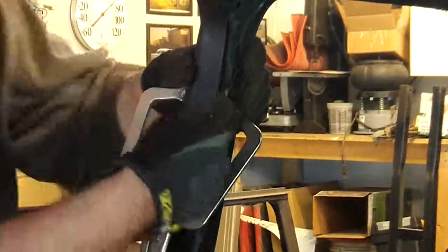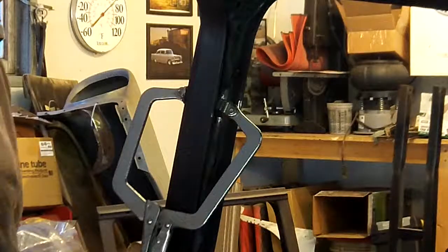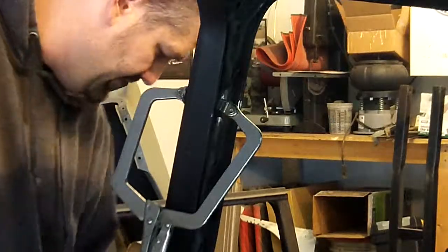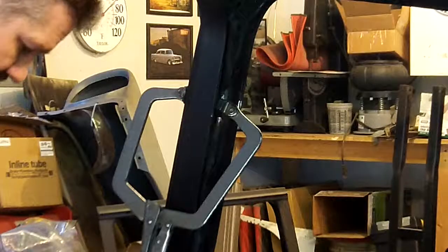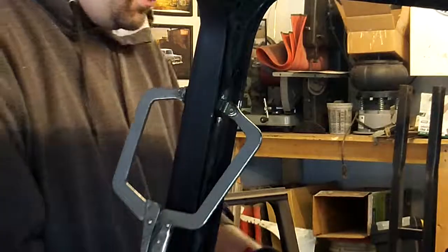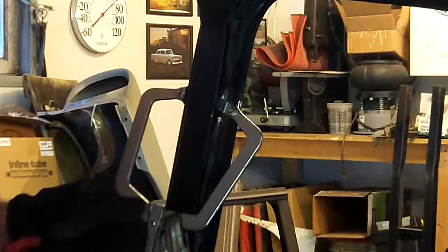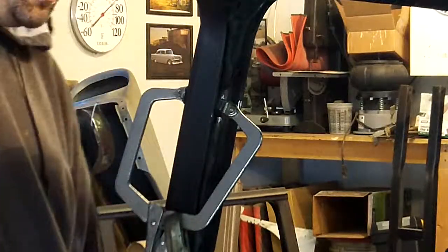Takes much tension to keep it in there. Hardest part is getting the wire feed down in there. I'm not a very strong welder to begin with. But it seems like on this type of thing, when I'm welding a nut, obviously pretty beefy stuff there, I can crank my heat up a little bit better. My welds aren't pretty, but they do penetrate. And that's what it's all about, right? Penetration. So I did three on the other side.